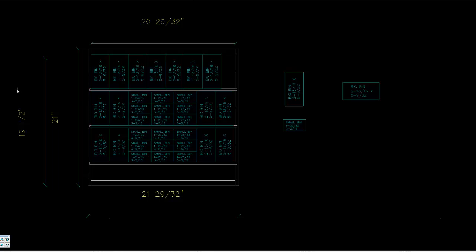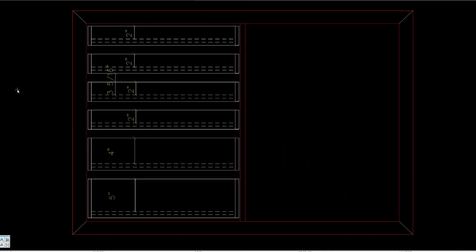Let's take a look at the drawer heights. There's also some pretty strict rules with these drawer glides on the drawer heights and how the drawer boxes are built. Not so much the height, but how the box is built. This dashed line across the bottom represents the bottom of the drawer. It's inset from the bottom of the box exactly 1/2 inch. I don't have a choice there. Where we do have a choice is the overall height of the drawers. Not much choice with the spacing in between the drawers either.